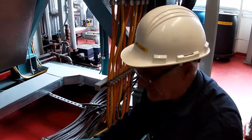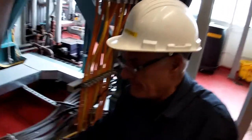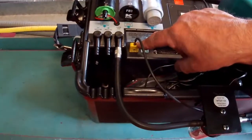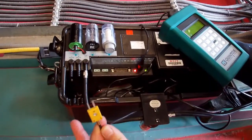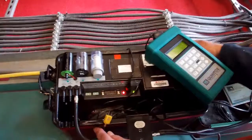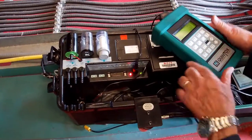I'm going to take this through a calibration right now. One of the idiosyncrasies about this unit — and it's not in the books — is that if you have the thermocouple, which is ungrounded, connected in there, it will not start up properly. So always remember to disconnect the flue gas thermocouple, which is actually on the probe, and disconnect the sample coming from the probe so it's pulling fresh air in, and then it's going to calibrate itself.